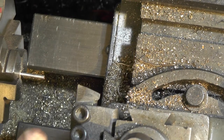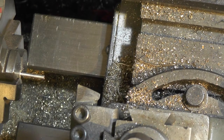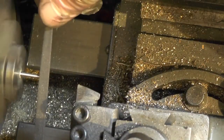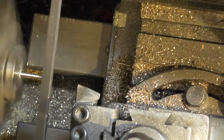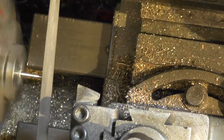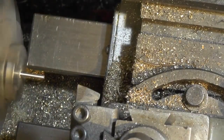Because it's stuck out so far and I'm gripping on very hardly anything really, I'm not going to chamfer it with a tool. I'm just going to chamfer it with a little three-cornered needle file. That chamfered edge is just to allow the die or die nut, whichever you're using, to enter that diameter easier.